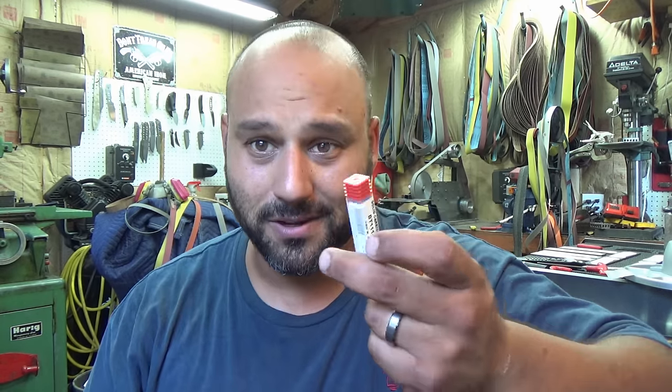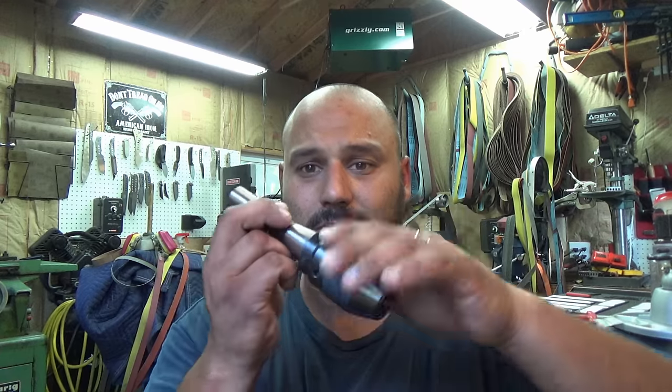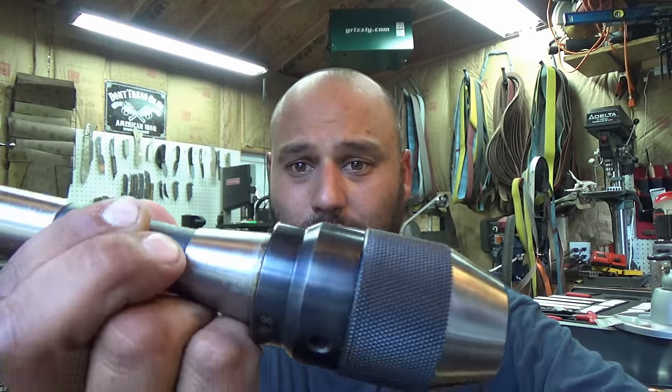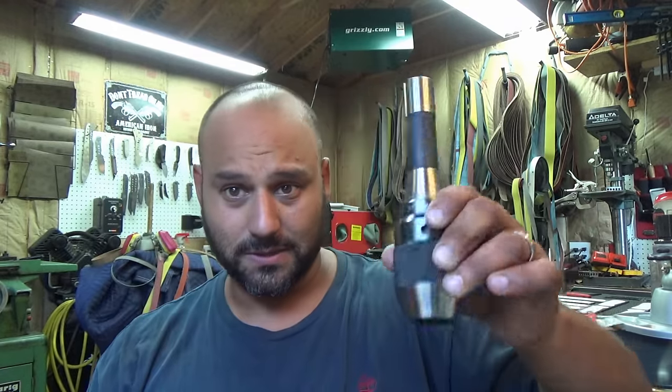But I was thinking about it and I realized that not only is this cutter expensive, but I don't have a collet for it for the mill. And I wanted to use a collet because I have one of these adjustable keyless drill chucks — this is one of those Chinese ones and to be honest, this thing is awful. It's absolutely terrible with a ton of run out, so I don't even use it. Waste of money.